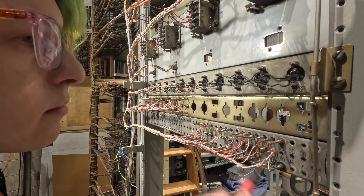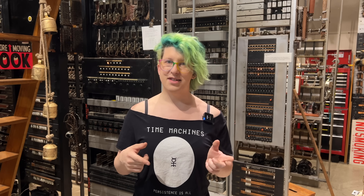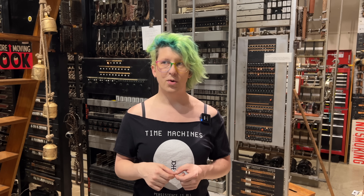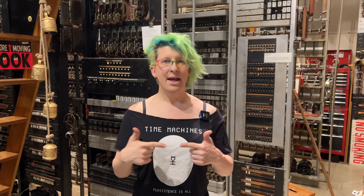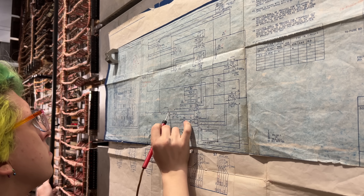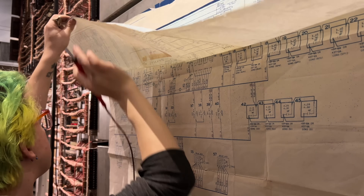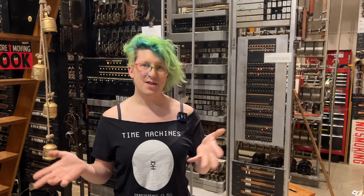There's enough resistance in the headset circuit that you don't actually blow fuses unless you accidentally short the probe itself between battery and ground, or touch a 130-volt lead without noticing it. As I was poking around and testing, I realized that I miswired a battery feeder on one of these relays, so just like a string of Christmas lights with one blown bulb, half of the circuit doesn't have any power. That's easy enough to fix now that I've spotted it.